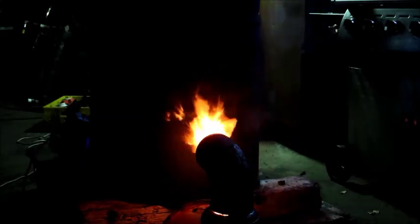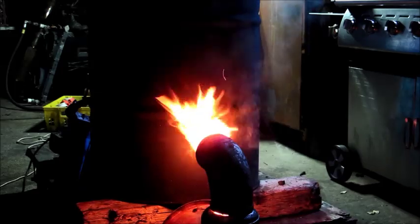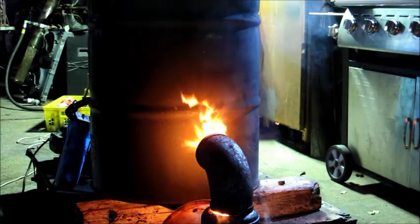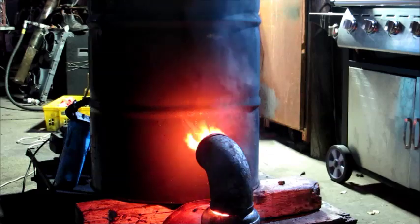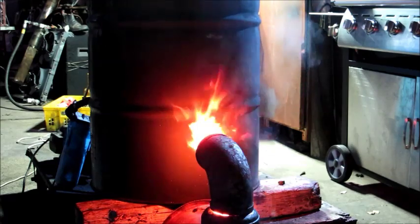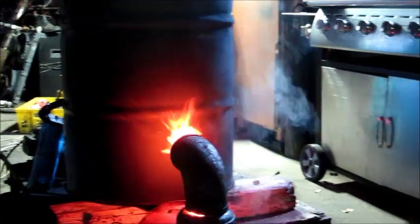In this configuration with this blower, the burn is probably putting out somewhere around maybe 20 kilowatts, maybe a little bit less. It'll do 10 times that, but you need to force the air in. The fuel in oil form is fairly easy to get in — one litre of oil is worth about 10 kilowatts — so it's more dependent on how much air you can get through rather than how much oil. As you can see it's starting to drop a little bit, so I'll give it a little bit of oil. You can generally see and hear the change when it starts to kick in.